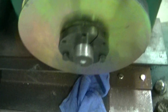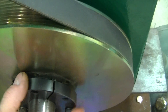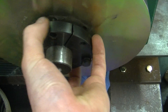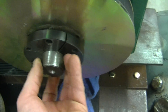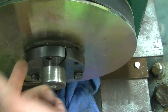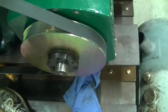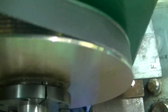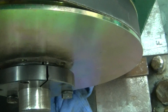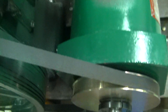Putting the pulley on — it's a tapered bush that sits in the centre of the pulley. You do up these bolts and it pulls it in and creates a nice tight fit. I guess this shaft might be slightly larger than it should be, because as I was tightening them up one at a time, the third bolt decided to shear off. So that's as tight as it's getting for now. I might buy a couple of high tensile bolts and try to go further, but then there'll probably be no hope of getting it off again.